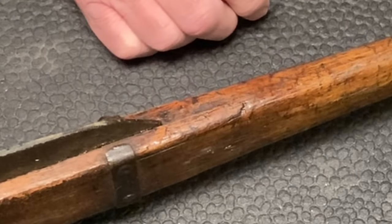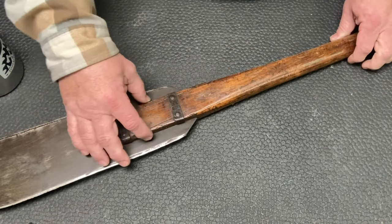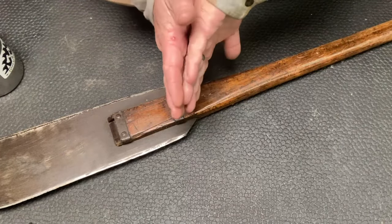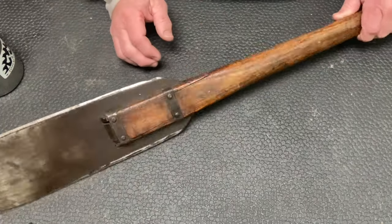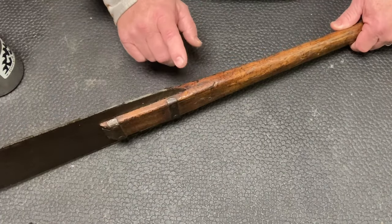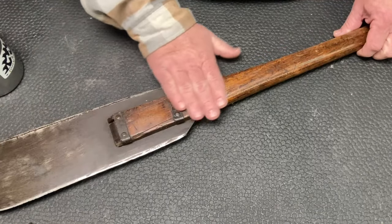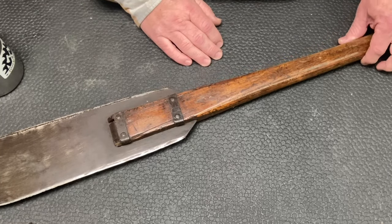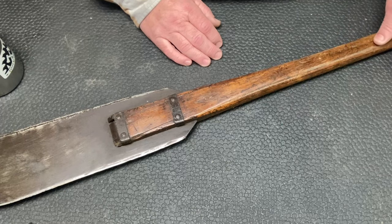five laminations. That way, in every lamination, I'll keep track of them. Once I cut one, the next one I will take and flip it over so that the grain does not match on the different levels of lamination. That should keep it from cracking and breaking out and should make it stronger. So let's go over, and I'm going to use ash for this project. Let's go over and cut that out and get it glued up.